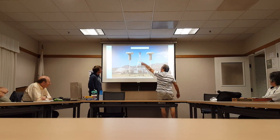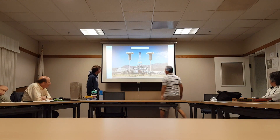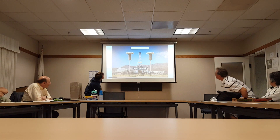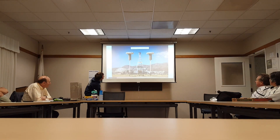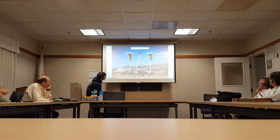I recognize what I saw in the van — these are the triple-wound ones, right? Yeah. So these are our toroids up here — they're eight feet in diameter, the minor diameter is two feet. These are resonator coils, eight feet tall by just under four feet in diameter. And this here is our transformer — you can see the primary going on right here with the copper tube, and the secondary going on right here. It's about five feet by five feet.